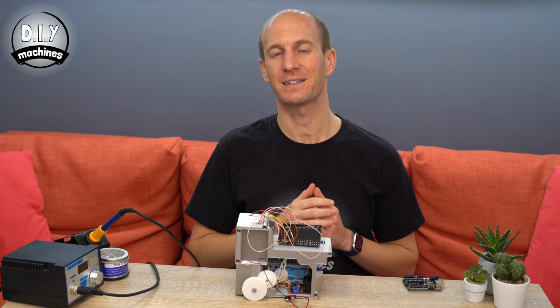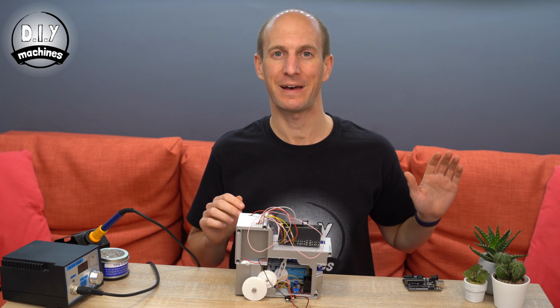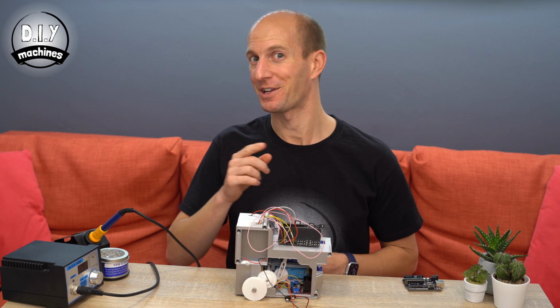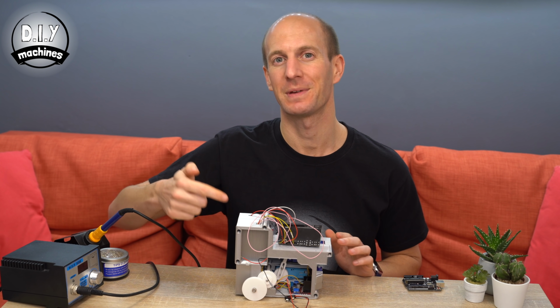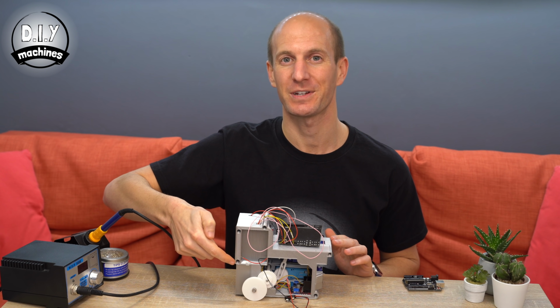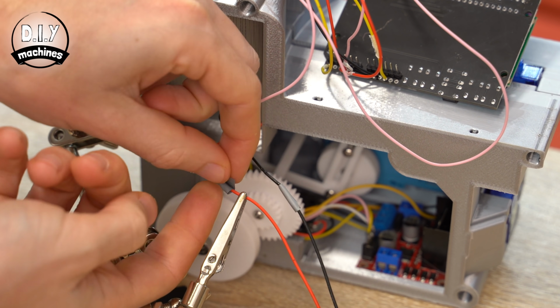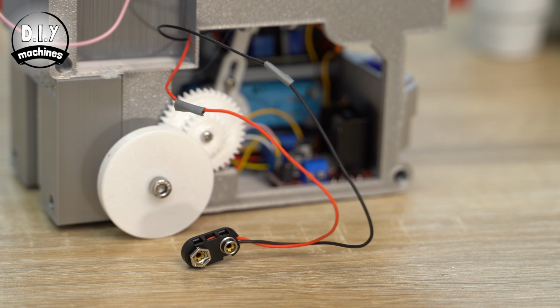So just before we attach the LCD display on top of our Arduino Uno, there's one more wire we need to connect, which we should have done earlier. But no problem, it's just the positive lead from the batteries. Solder the 2 wires together and then add some insulation tape or heat shrink around our joint.